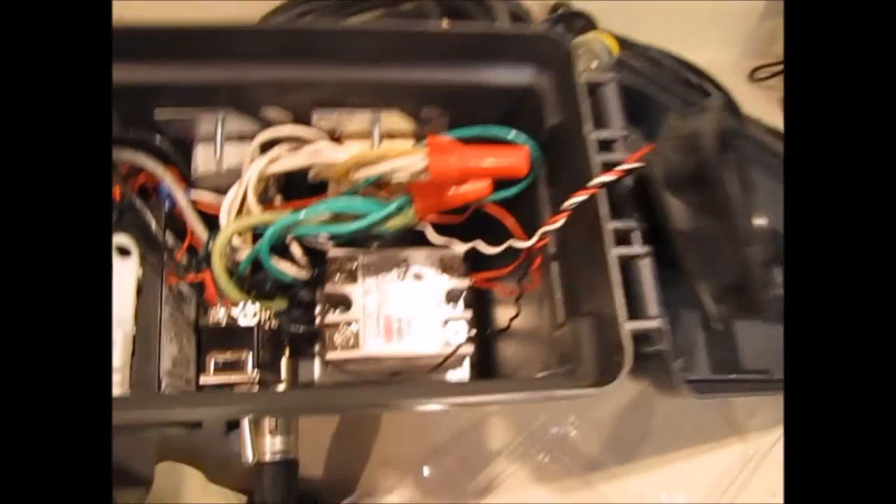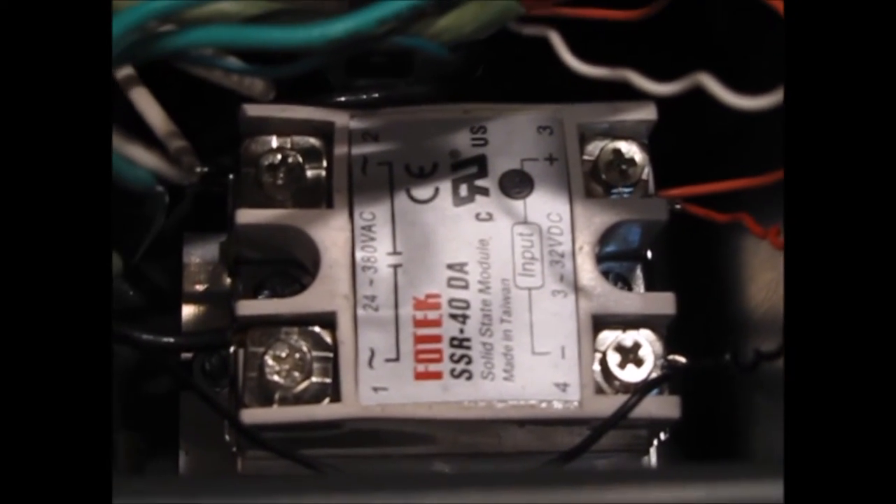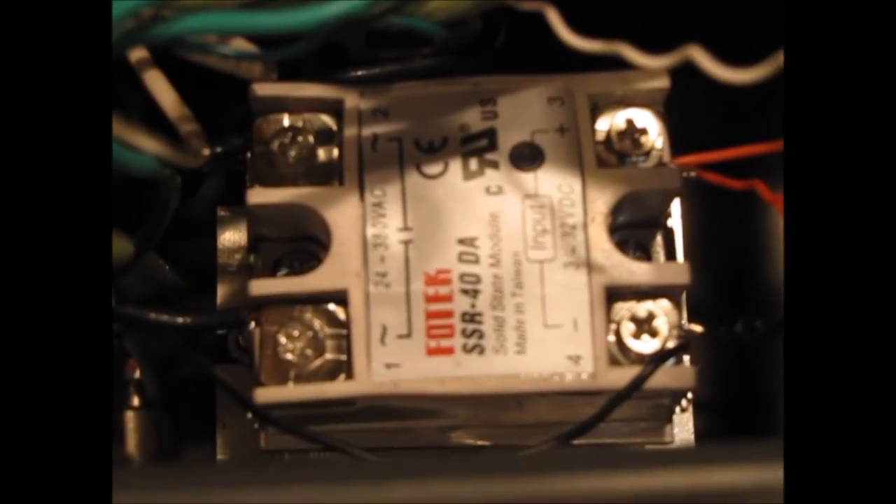Since then I've been doing a little experimenting. If you look, you can see it's a little bubbly on top — that solid-state relay is not working anymore. So what I'm doing is I've ordered some new ones — one as a spare and one to use. I also took a fan off the heat sink of a dead computer that was on the CPU and put it in.